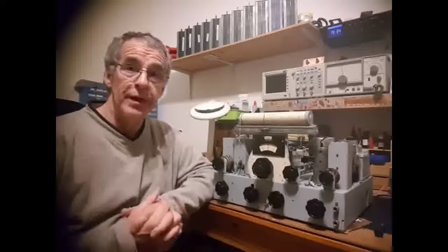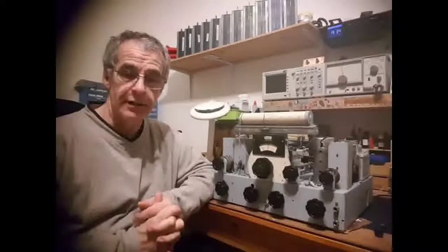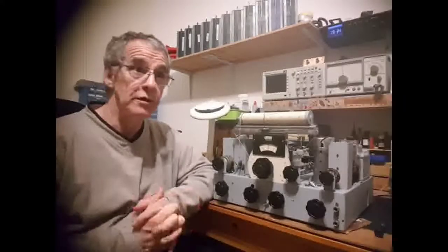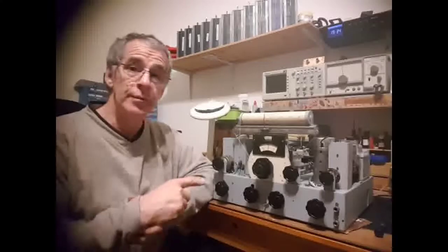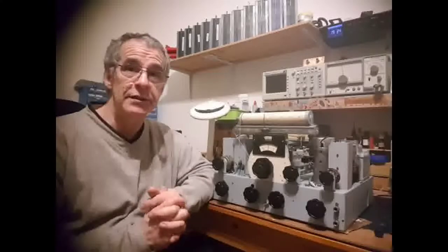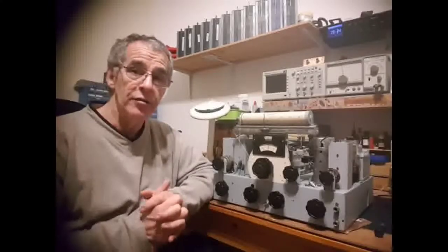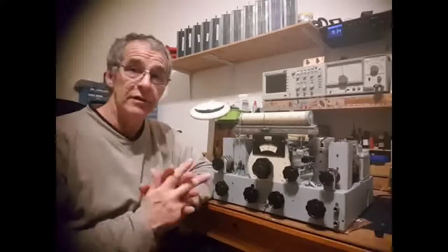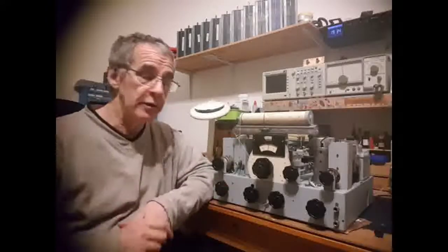Yesterday probably had better conditions in the afternoon, and I think I should have made the video yesterday, but I'm not sure what the conditions are today. I've got it connected up to my doublet. It's up at 15 meters. It's cut for the top band, 160 meters. It's on three masts there, and it's fed with 450 ohm window line, and I've got it directly into the dipole input on this CR100.